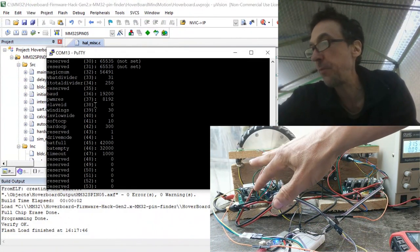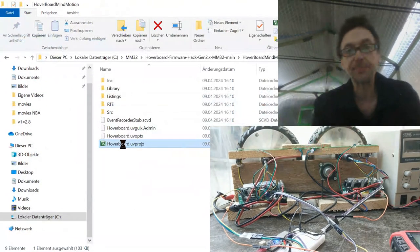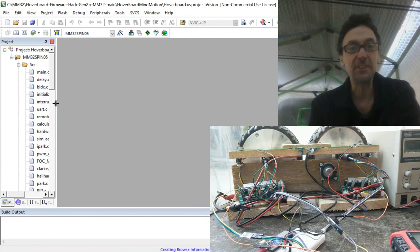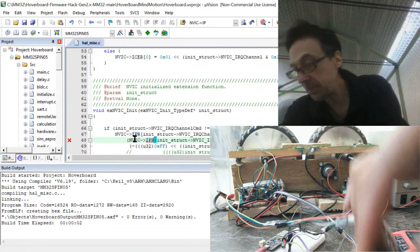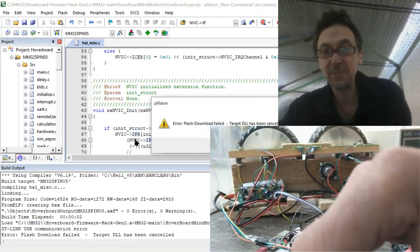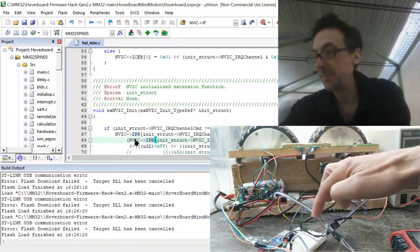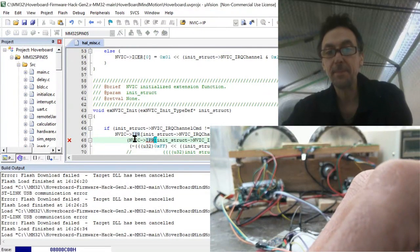Continue with this board and flash the main firmware. When we flash the pin finder on this board it will not react because it already has the main firmware. The end user — the BDC, brain degenerated consumer — should only need to download the two binaries and flash it. The Keil stuff is only for developers. Target is correct, hit F7, then insert the USB dongle and press F8 to flash the main firmware. Sometimes this happens and I haven't found out what to do against it. Sometimes pressing no-reset helps but mostly it doesn't. Now it works.